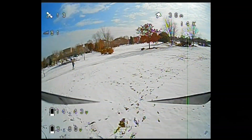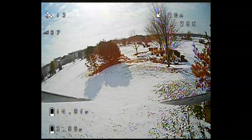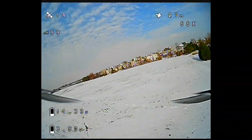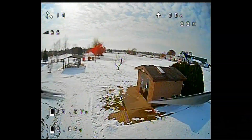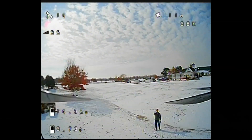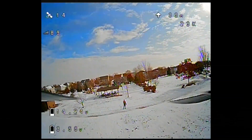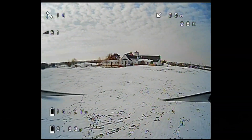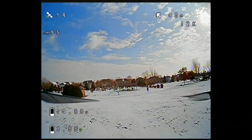The VTX is pretty powerful so I'm not getting a ton of breakup — everything is pretty solid. In the OSD you can also see the number of satellites: 13. You do have to wait for about nine or ten satellites before you can actually take off as a safety feature. I'm using an XM Plus receiver which does the trick, but if I was really serious about this quad I'd put Crossfire or an R9M on there. This really makes a nice long-range quad — just cruise with it. I was quite pleased with how it performed. $120 for a GPS drone is a steal — I'd jump on this.